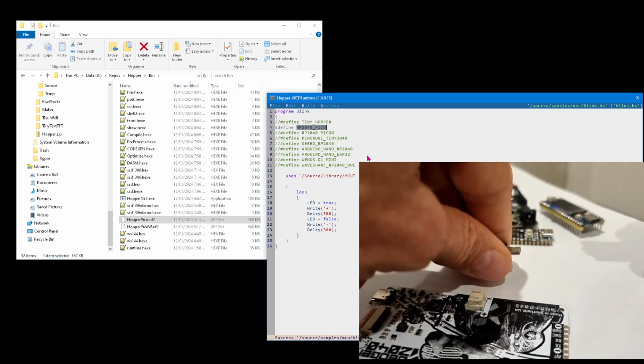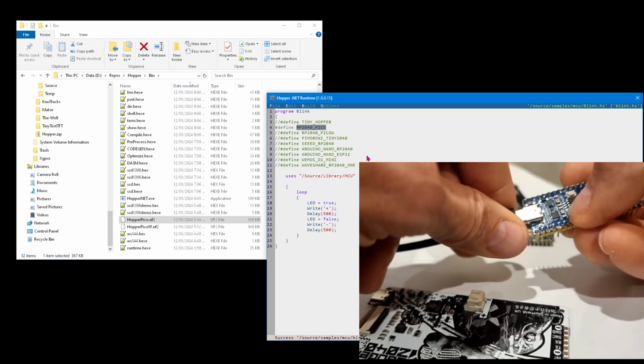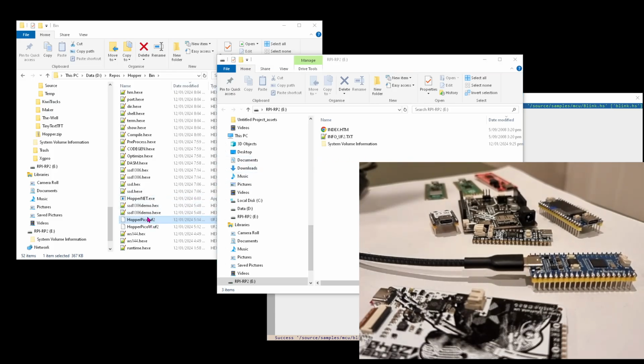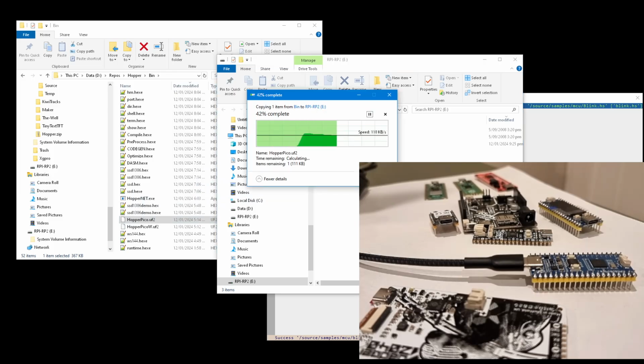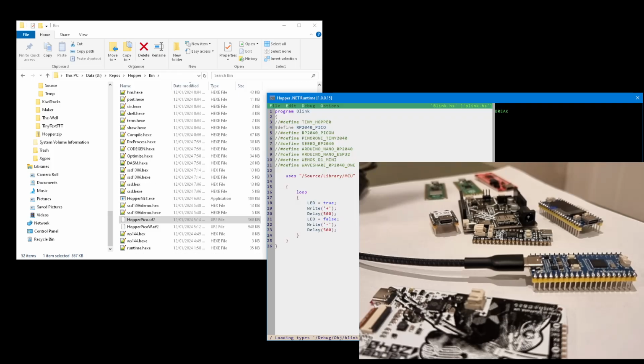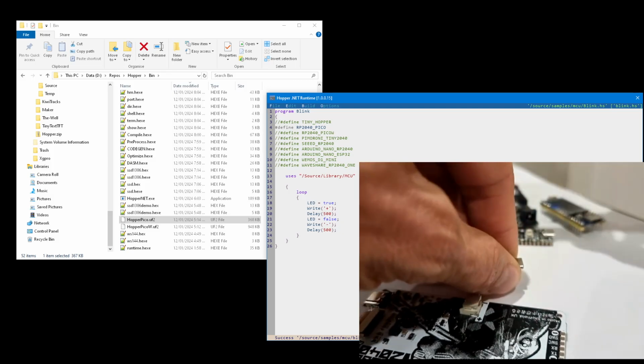Here's another one. This is a Waveshare RP2040-Plus, it's called. Hold down the boot button. Okay, comes up as a drive. Drag and drop that. So I'm flashing the firmware onto it, just like you do if you downloaded the sample. And now we're going to run this. Build and F5. Do we have a blinky light? Oh, that's a pretty bright light. I think they overdid it a little. Okay, let's stop that one, exit. We've got another one that works. Go and add it to the pile.